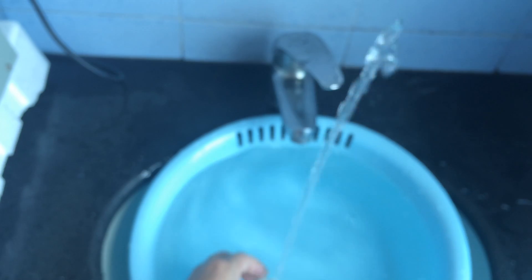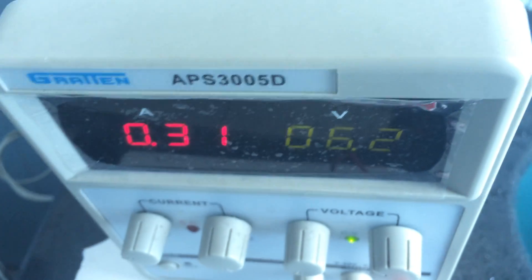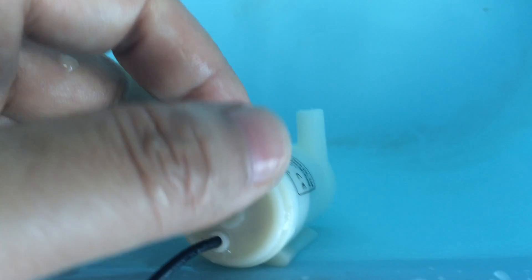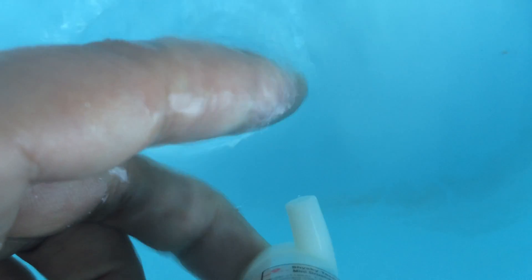Totally speaking, this pump's performance can be taken as nice. We can see its current value at this moment is 0.31 amps, so the total power consumption is about 1.8 watts. Its flow can be taken as nice. We have to clarify again that this pump has a brush motor design, so its lifespan may be several hundred hours. Long-time continuous work is not recommended — work and rest is the ideal condition for this model.